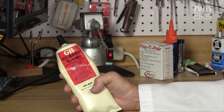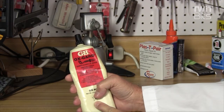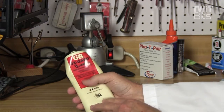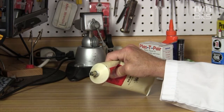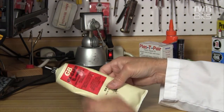Now we're talking about protecting things — there are a lot of different things that need protecting. One thing I like to use is Ox Guard. This is used for dissimilar metals, like if you've got a copper terminal and you're connecting an aluminum wire with it. Eventually that connection is going to oxidize and corrode. You take a little bit of this Ox Guard — there's another one called No-Ox — it's just a black paste. You cover your wire and your connector with it, then screw it together, and you're not going to have corrosion on it.